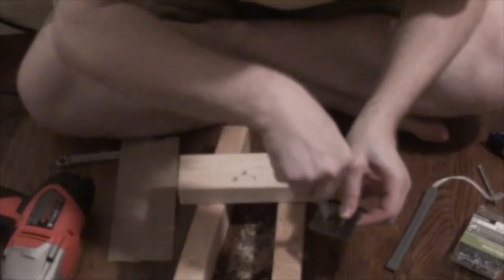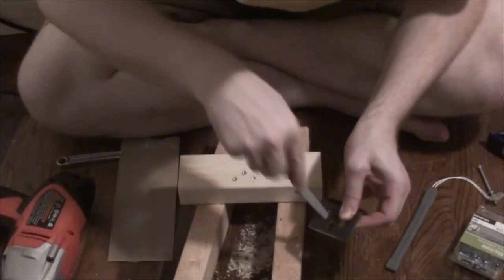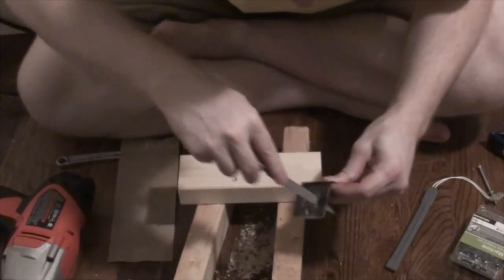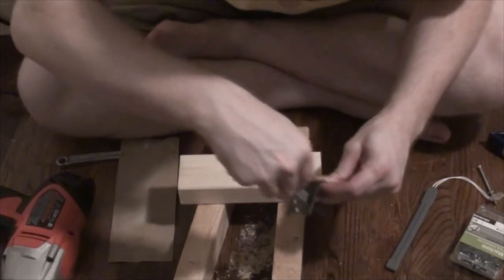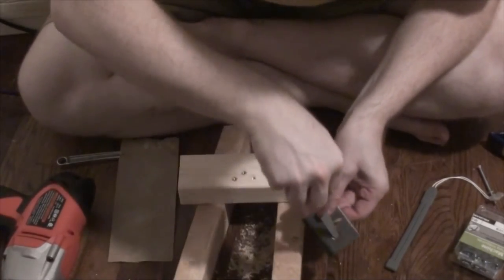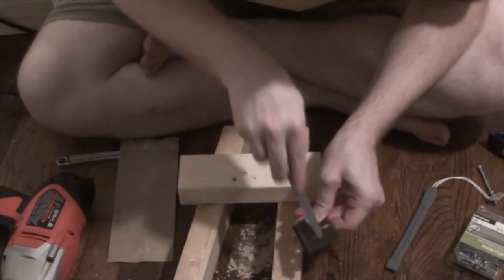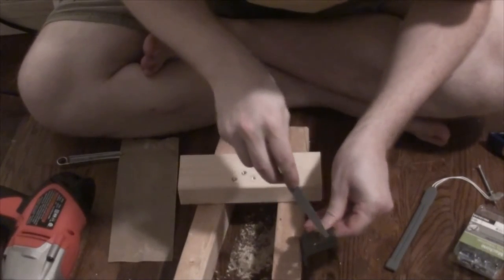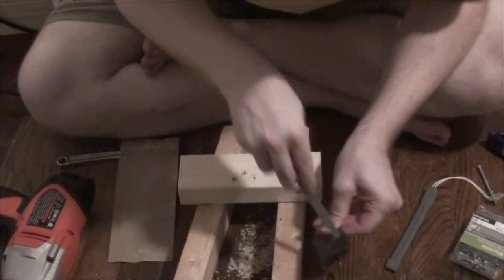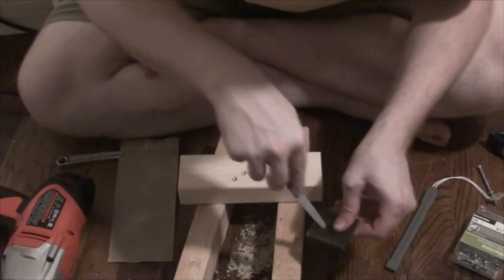I'm doing it one by one as I install these, but I've done it for all the rest of them now. The spacers I'm putting in to let the screws tighten down while still allowing the bracket to move freely — they're a very tight fit. Any kind of protrusion or roughness on the inside of those holes will make them not move up and down smoothly. Using the file removes any little poking-out bits and makes it all move much more nicely. But the file on its own is not actually enough to make this all work — I need one additional ingredient after that.